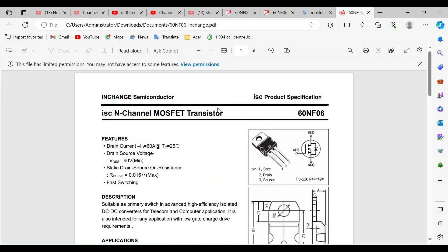We are on the datasheet of the power MOSFET on the amplifier. As you can see it has three pins: pin number one is the gate, pin number two is always the drain - the middle point, the one that sits on the heat sink - it's always the drain.